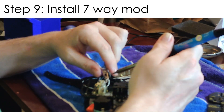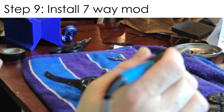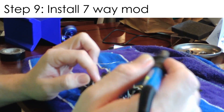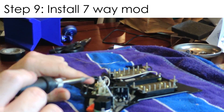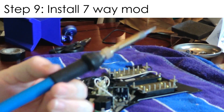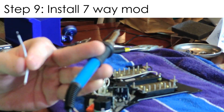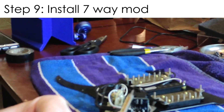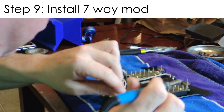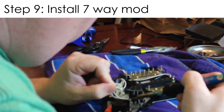When you're doing stuff like this, be careful not to burn wires, not to pull wires out when you're heating stuff up, and not to lay your soldering iron on something without realizing it's touching. This part was a little tricky just because of those things — it was really hard to get some of these wires in place, but it wasn't too bad. You just have to be careful. For small wires in really tight spaces, you may want to use alligator clips — it can be safer, keep your fingers from burning, and make it easier to control the wire.